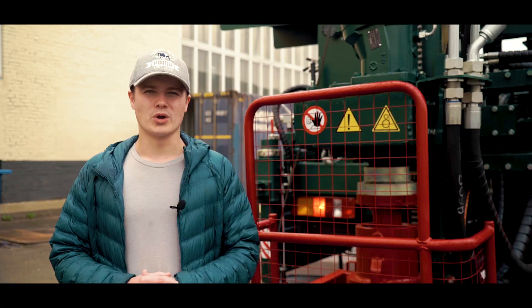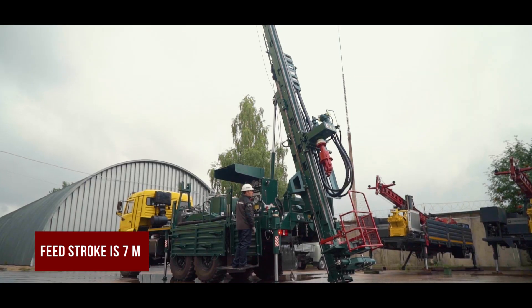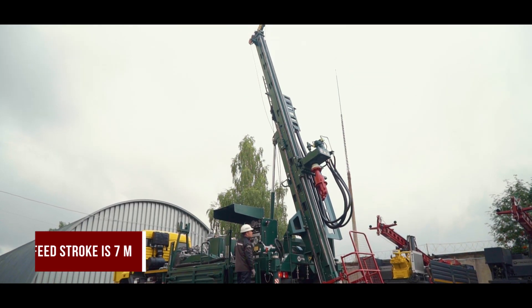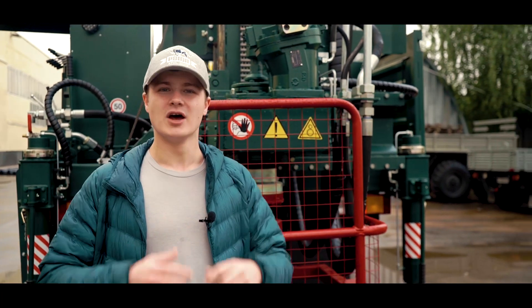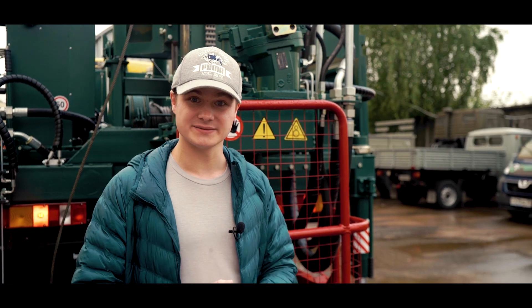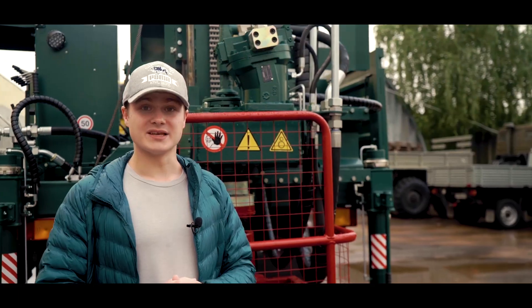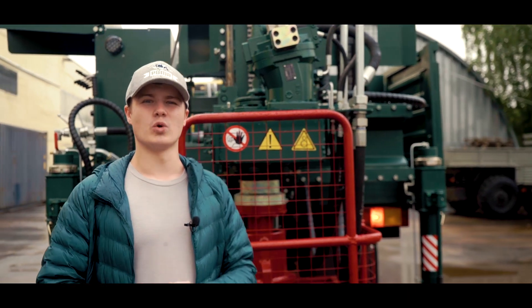The feed stroke of the drilling rig is 7 meters, which allows us to use pipes up to 6.2 meters in length. Compared to using pipes 4.5 to 4.7 meters long, this reduces the number of connections between pipes by up to 30%, increases reliability of the drilling instrument, and reduces the price of the drilling column by up to a quarter.